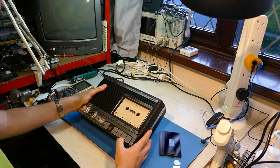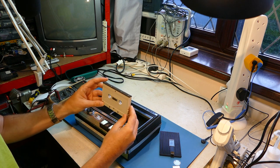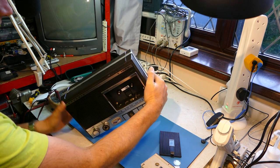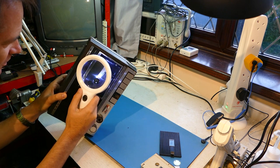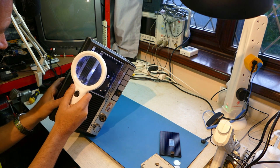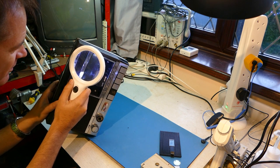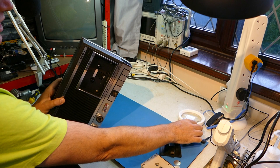Is there a button somewhere? The stop button! Of course. Remember, it is Grundig. It's not going to be easy to work, is it? So we have a cassette we can play with. The heads look to be in very good condition. This hasn't had a lot of use at all. Let's do a closer look. Pinch roller — it's had a little bit of use, but not much. That is in tidy condition. You can see a hint of the main head having been used. But I'd say that's in pretty good shape.